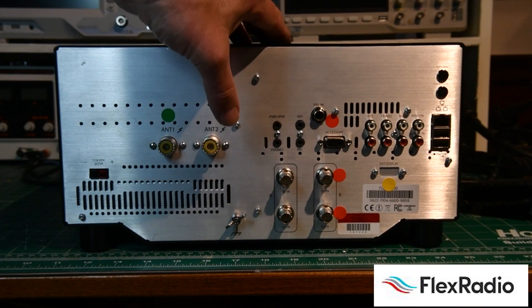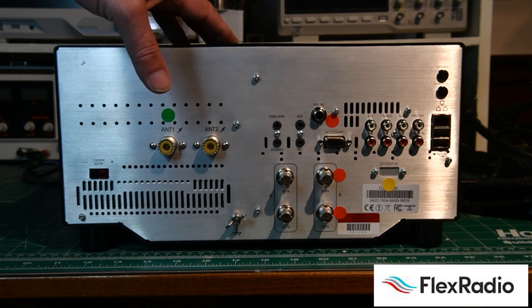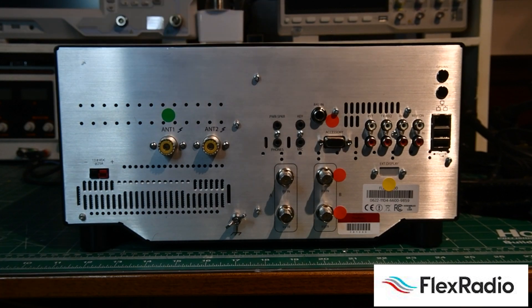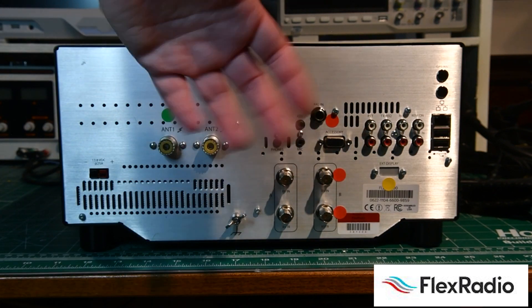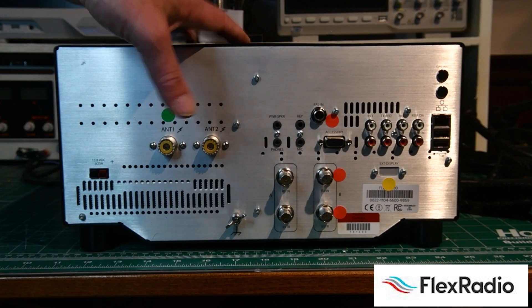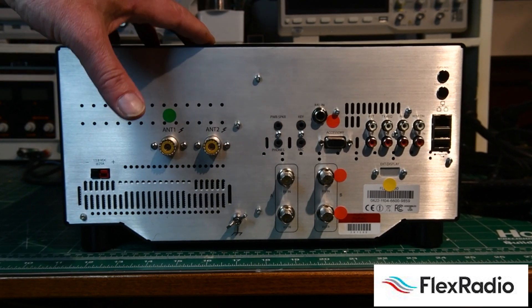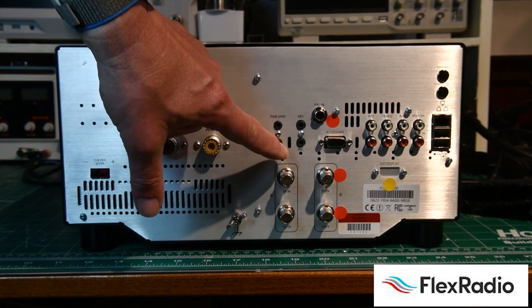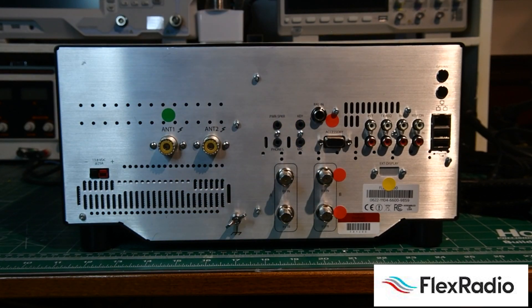These four black squares here are really key as well. Powered speakers hook up here — there is no speaker on this radio, so you need to provide your own speakers, or you can play the speaker audio through your PC by enabling PC audio in SmartSDR. Headphones plug in here — these are all one-eighth inch stereo, because the radio outputs a stereo signal. CW key is also one-eighth inch stereo; you can use a straight key, just configure it in the settings. And lastly, a mic goes here — pretty much any microphone will work, using a fairly typical gaming headset connection.